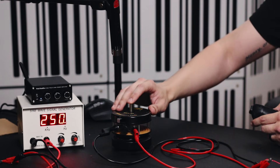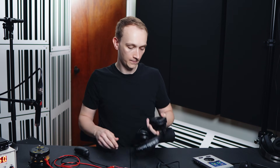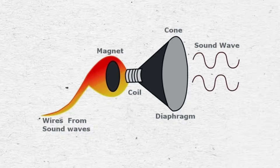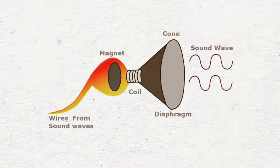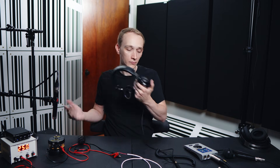I could theoretically move this up and down a thousand times per second and record a one kilohertz tone, but I haven't had enough coffee for that yet today, so let's use something a bit more lightweight and see if we can speak into it instead. These headphones are designed to take current from the headphone amplifier and convert that into vibration in the speakers within the headphones. But if we disconnect the headphones from the headphone amp and instead connect them to the input on my audio interface, we should be able to use the headphones as a microphone. Now I can use my voice to vibrate the speakers inside the headphones. The speaker cone acts almost like a sail and moves with the sound waves, which will move the coil within the magnetic field of a fixed magnet within the headphones, and all of that results in current on the coil, which can be connected to the input of my audio interface and recorded into a DAW. Let's test it out on a guitar.